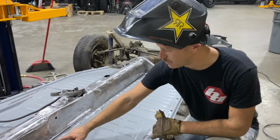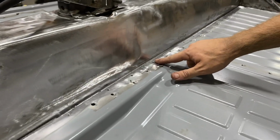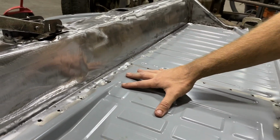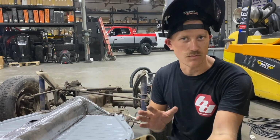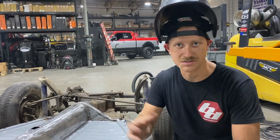I went ahead and punched holes all the way through the sheet metal all the way down. So I start by tacking these holes in. That gives me a good solid foundation to weld into, and it minimizes the sheet metal warp. When you're working with 18 gauge metal, it's really easy to spread heat where you don't want it and get the metal to separate, which causes your weld basically to cavitate, and you'll see holes pop up in your welds.